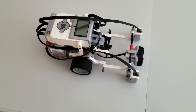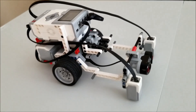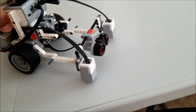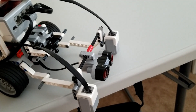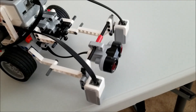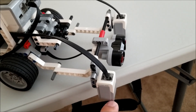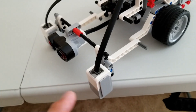Here is my cup-pushing-off-the-table robot. The reason I have two color sensors is because if I'm coming at an angle and pushing like this, I do not want just one color sensor. By the time it sees nothing — as far as the program is concerned — it will be off the table. So the two color sensors give me the best coverage. If I'm coming from this angle, this color sensor notices I'm off the table; from another angle, the other one detects it. I'm just trying to cover as much area as I can.